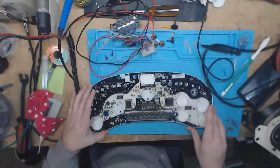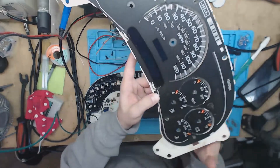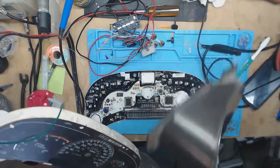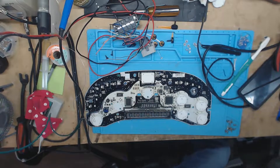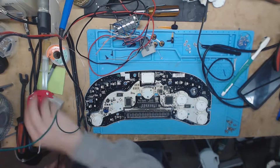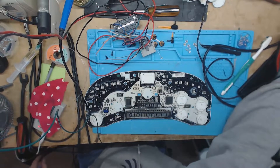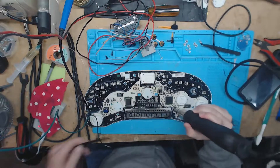Let's get the hot air station out and actually do the repair for this one. Look at what he did to this screen here — tore it up, it's a shame. He also broke the tabs. He's been doing this longer than I have — it's just pathetic. Let's get some flux and put a proper amount on the EEPROM, then get this hot air station going.